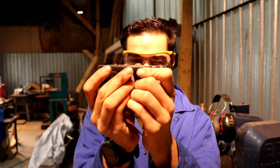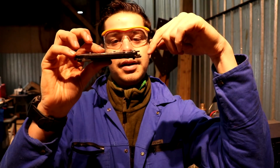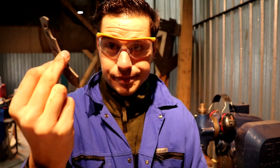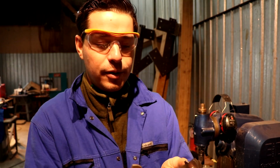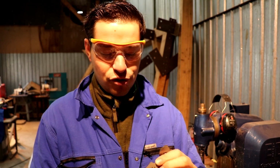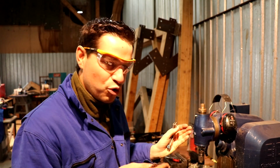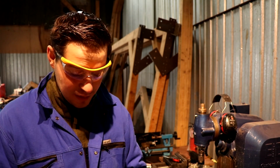There is one thing, and I looked at one of my cheap AliExpress knives to figure it out. This lock bar is flat now because the ball is completely inside the hole, but when it goes up it springs like this, and therefore this liner won't fit. So now I have to scallop out material in here, because when the lock bar springs out it has pockets in here. These are the nice jobs you look forward to when you're being shouted at by your colleagues at your regular work. Just drawing it on, milling some titanium. I've never used the mill just for removing some material. It's always drilling or on the rotary table, so yeah, looking forward to it.